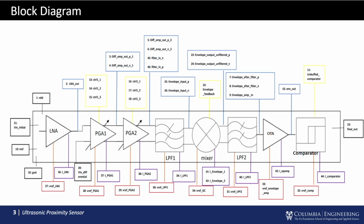The first low-pass filter has a cutoff frequency of 110 kHz, which keeps our desired ultrasonic signal at 40 kHz and at the same time filters out unwanted high-frequency noise. The cleaned signal is then sent to our envelope detectors.